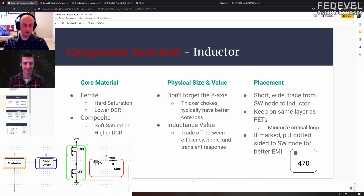What does 'wrong' mean? So if your inductor is marked — look at this little example I drew here — there's a little dot on some of these inductors. That dot should go to the switch node as you place it on the board and solder it down. The switch node is where your MOSFETs are switching. As they build the inductor, they have their coil wire and they wind around, and there's a coil on the outside. The coil inside, if connected to the switch node, means the other node goes to the output — which is a quiet DC node. Since that's on the outside, it shields the noisy switch node from radiating outward. But if you put the inductor on reversed, your switch node ends up on the output side and can radiate out even with a shielded inductor.